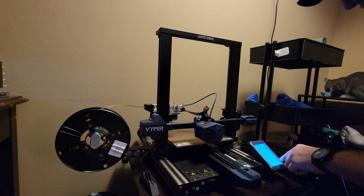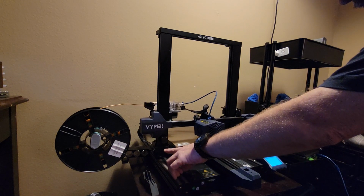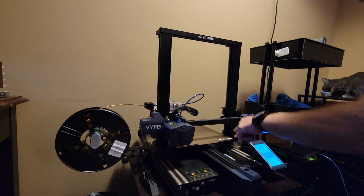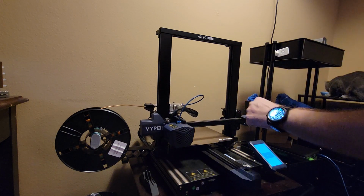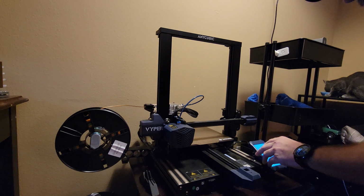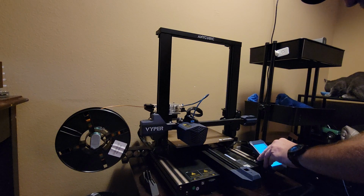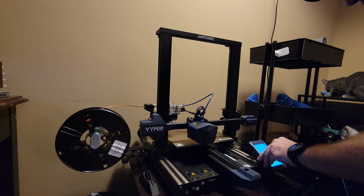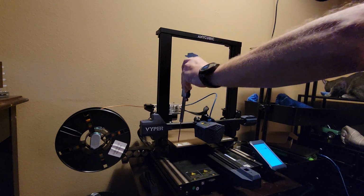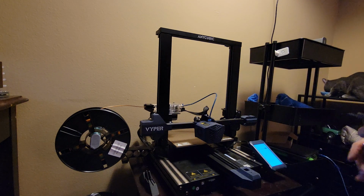After that, go ahead and home it again so that it goes down to where the end stops stop at. Each one does the Z screw separately. And then once it homes, you can move the X carriage back out of the way. Check it again to see if you've moved it enough to have it at the same level with your bed.